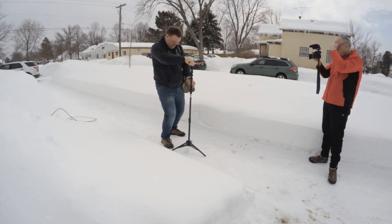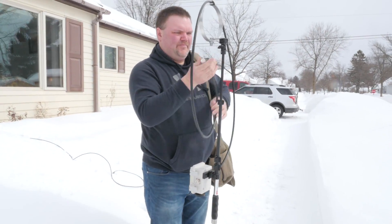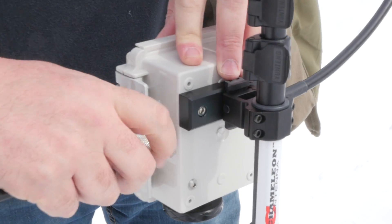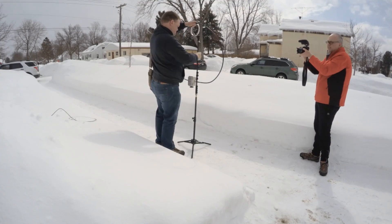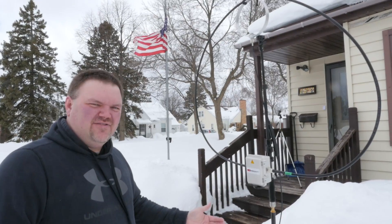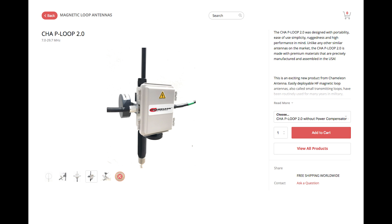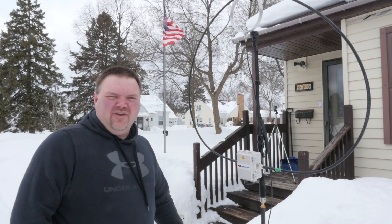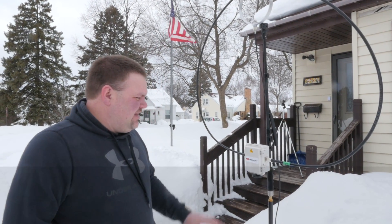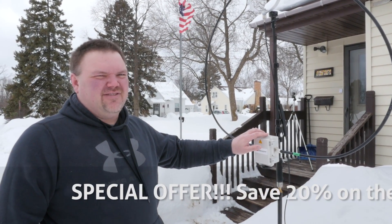Joe's going to tell us a little bit more about the antenna and how it works, and then we'll finish up with our impressions of it. So this is Chameleon's latest mag-loop antenna, the P-Loop 2.0. This is a QRP-intended antenna — a maximum of 25 watts sideband, 10 watts for CW or any full-duty-cycle digital modes such as RTTY or FT8. It covers 10 meters through 40 meters, getting down to about 6.8 MHz, though anything below 6.8 megahertz is not very usable.